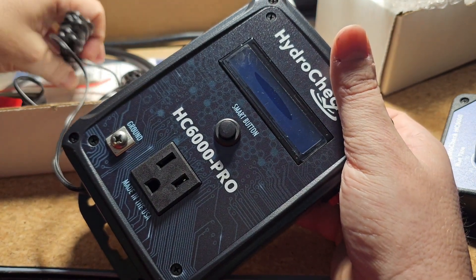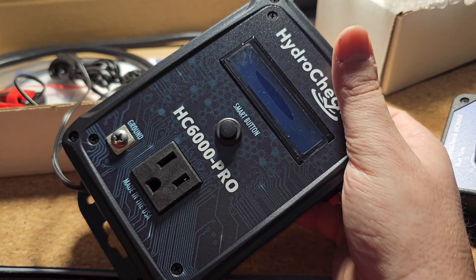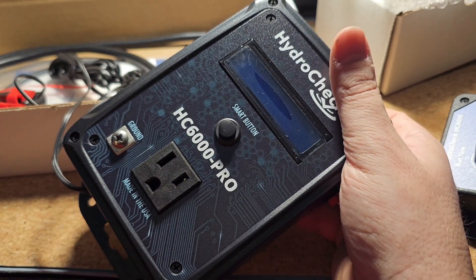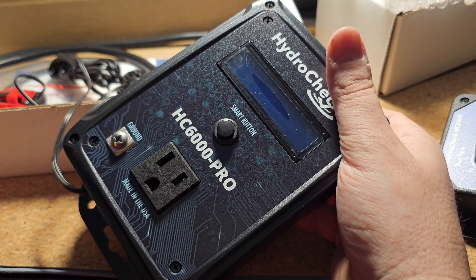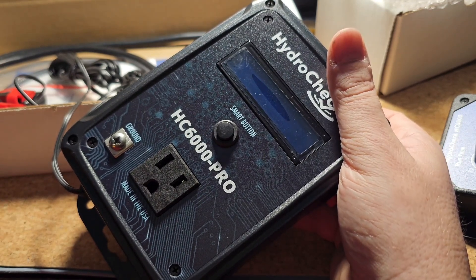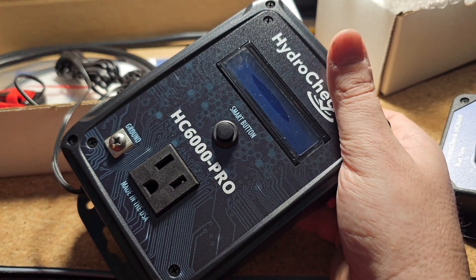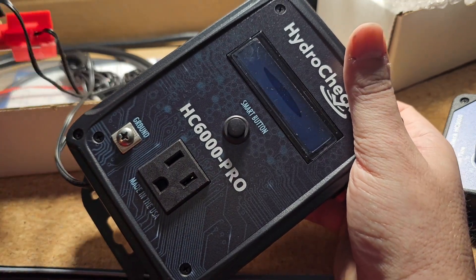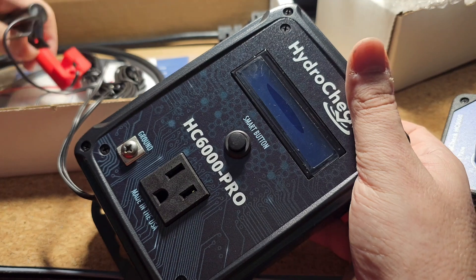You're no longer locked into that short eight-second runtime. You can now run it for 20 or 30 seconds. What I'm basically going to do is let my sump pit fill up maybe three-quarters of the way, because right now it only fills up maybe about a quarter or three-tenths of the way. There's a lot more room for it to fill up and the float just doesn't let you do that, so this lets you optimize your pump better.